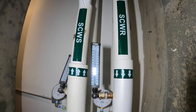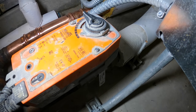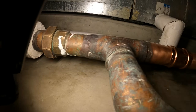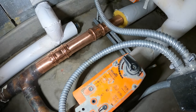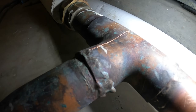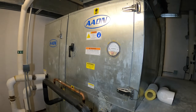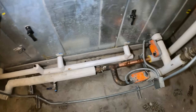All right, valves are open, everything's put back to normal. Even put this actuator back in its place — just a simple one screw, sits on its base — and that right there is a beautiful thing. No leaks! You can see — absolutely no leaks there, that is phenomenal. Looks super clean compared to those clumpy, lopsided connections. At least those are brazed, which I trust more, but that old solder joint looked terrible. Put some Teflon tape on this end cap to make sure it's nice and clean — you don't want any little drips there either.